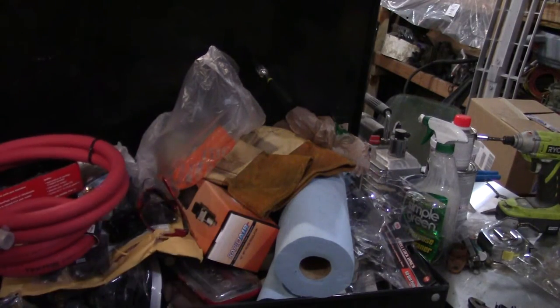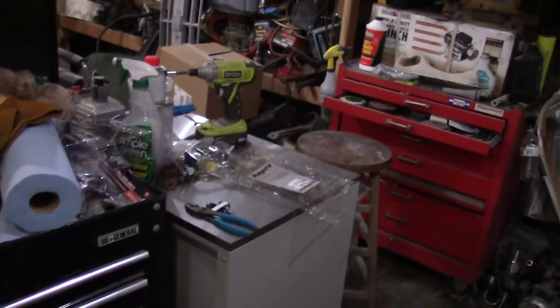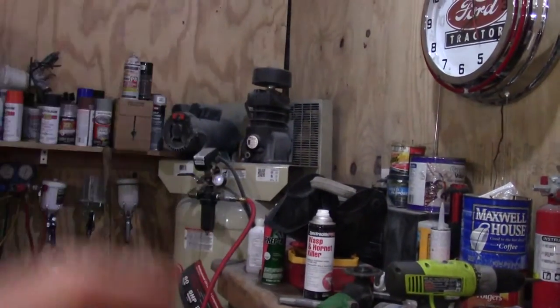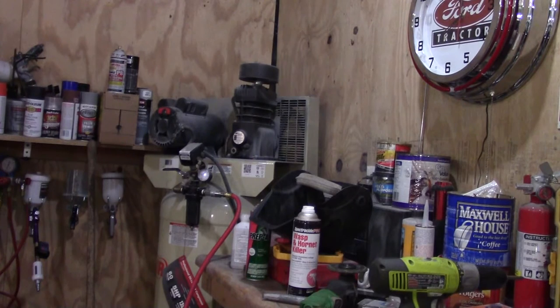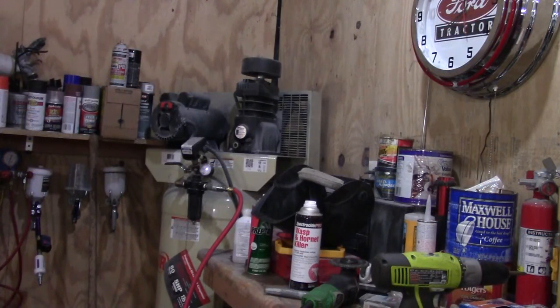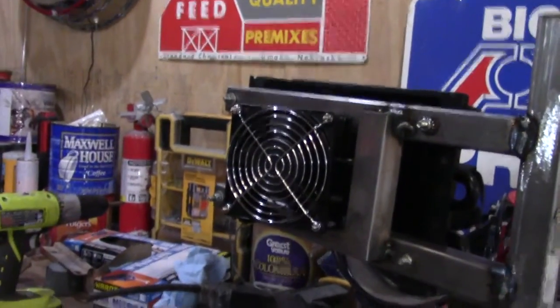I've also got some half-inch copper tubing. The three-foot hose will be coming out of the compressor going to the cooler, because I'll have my copper tubing going up. The six-foot one will go down to the water separator, through the water separator, then I'll go copper from the water separator back to the tank.